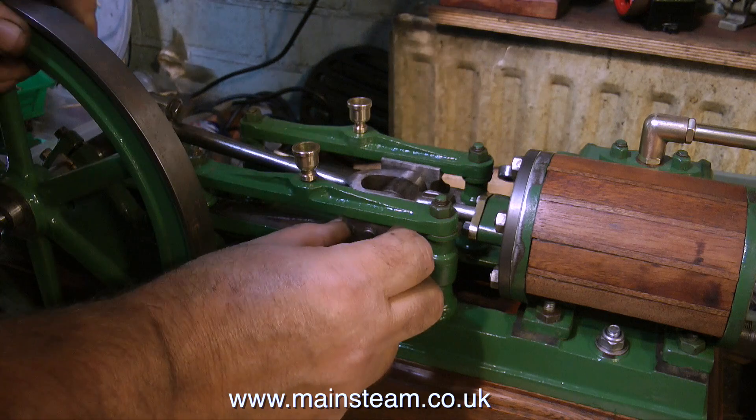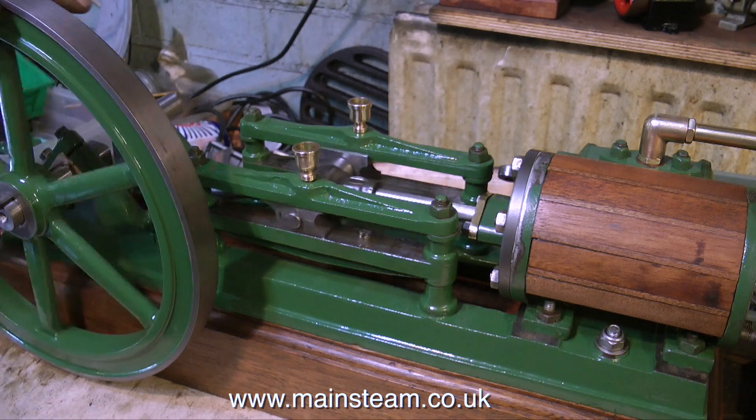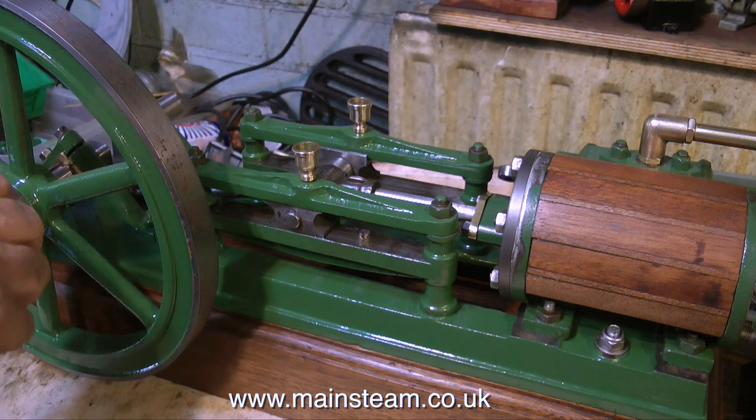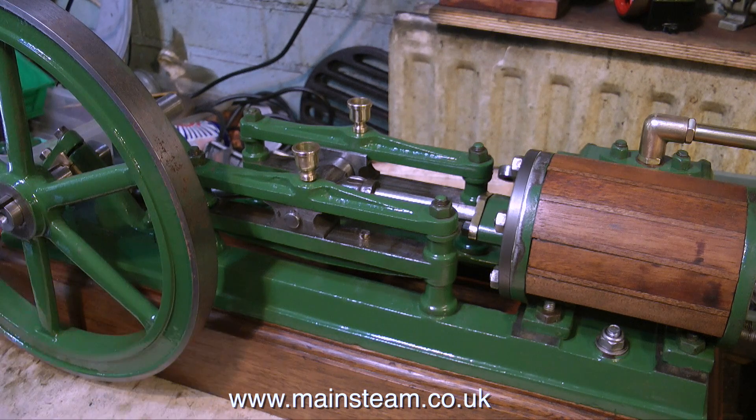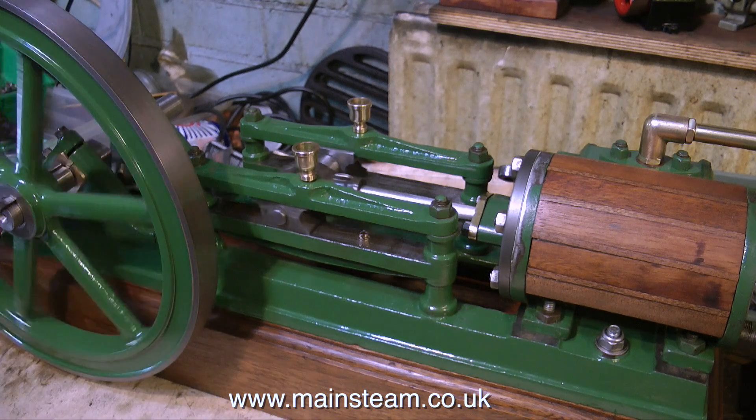What I'm probably going to have to do is shim it onto the shaft, using some very thin shim steel that I have. The shaft is exactly three quarters of an inch in diameter, and the new crankshaft is very true indeed. With a dial test indicator in the lathe on the crankshaft, there is negligible run-out.